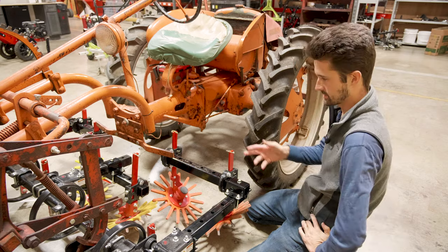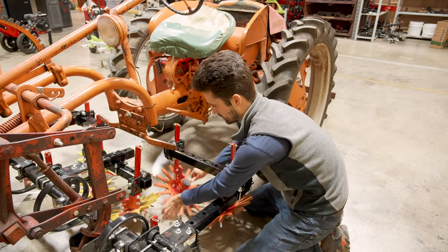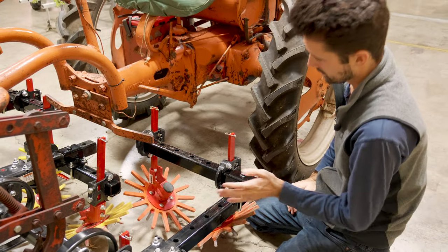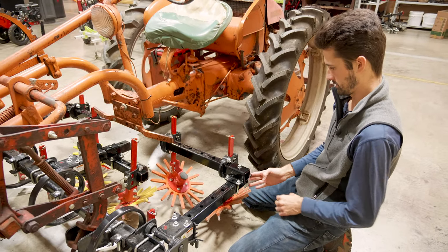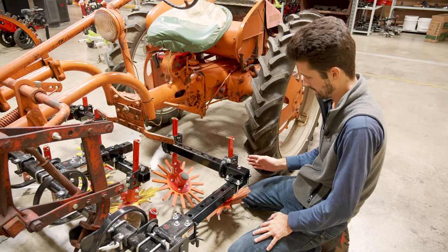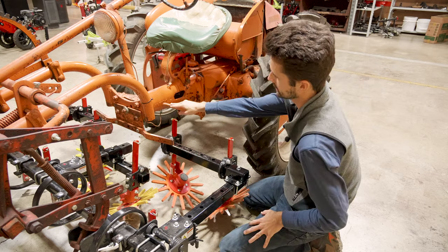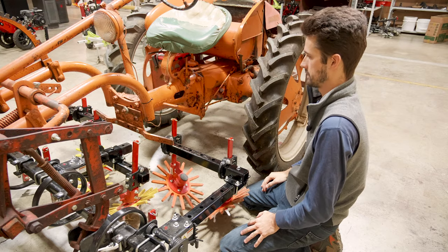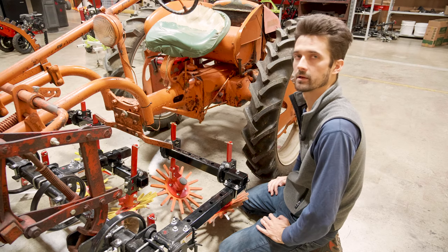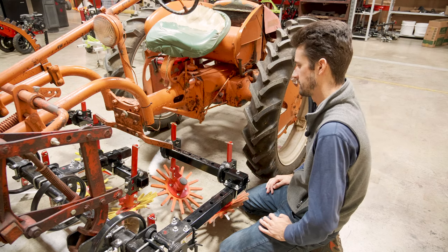Here's the 13-inch side — you can see we're getting a little tight on some things. This position right here is not ideal; it can catch and drag, wiping out some of your crop. This needs to be back further, and this is as far back as it can go on this mod bar. We could go to the next length to bring it back farther, which would help keep it away. But even then, lifting this up gets really close to your foot rest, creating pinch point concerns. Without the extension, we really would not recommend trying to do the 13s.